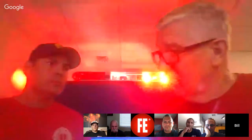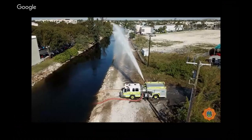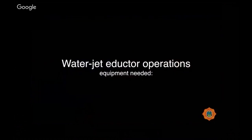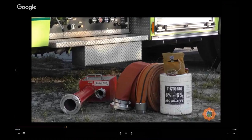Sarah, let's run the next video. If you've never seen a jet siphon — water jet inductor — this is really neat. By the way, Dave, you're practically a radio announcer for hockey games with how well you narrated that. The next video: we're going to be using a water jet inductor. There's some drone footage. In this setup we use two, but starting with one — this is a video I created for our pump operator class. We're discharging water at 175 PSI and the water being pushed back comes back at about 200 gallons a minute. That water is recirculated continuously.